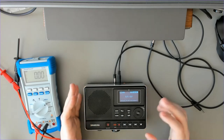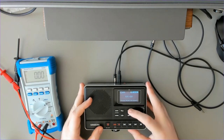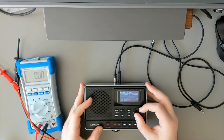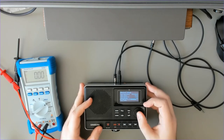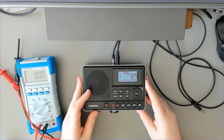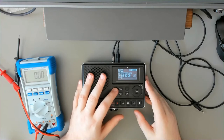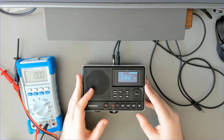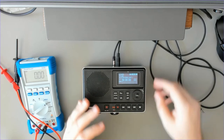Now we need to do a bit of configuration. We go into the menu: Menu > Record Setup > Enter, and there is an option called Record Standby — we will turn it on. Come out of the menu. We can also take a look at the record options: there is a source button to switch between line and microphone. We need to have it in the line mode.